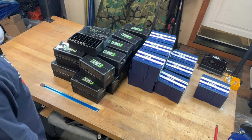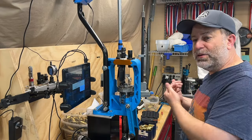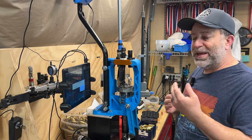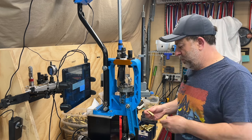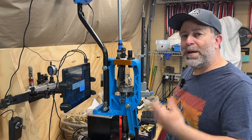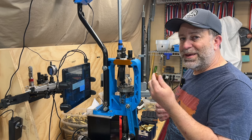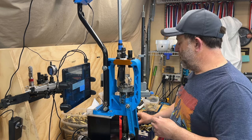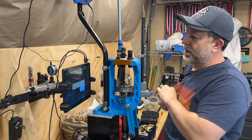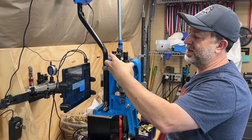We have a thousand — let's get turning. It's all about getting the brass ready to go into the neck turner. There are a couple of ways this can be achieved: you can simply expand the necks on a 6.5 PRC neck up to 7 and then load it, shoot it, and turn them after the first firing. Or, like what I'm doing, I'm going to be necking them up with my expander mandrel. This tool head is already set with a brush before and a brush after — there's no reason not to leave those in.